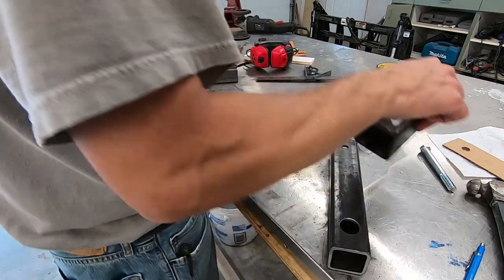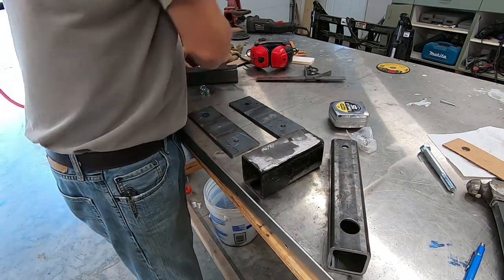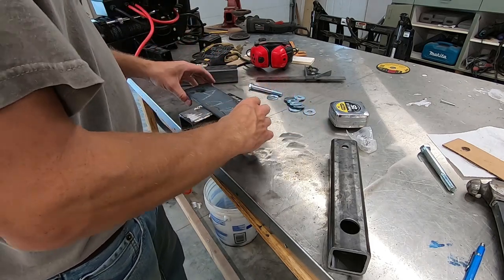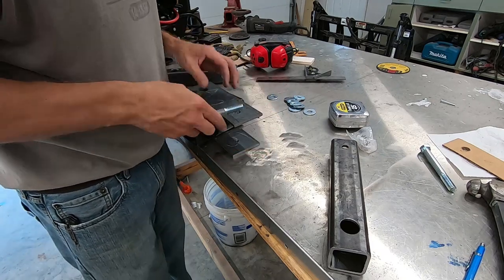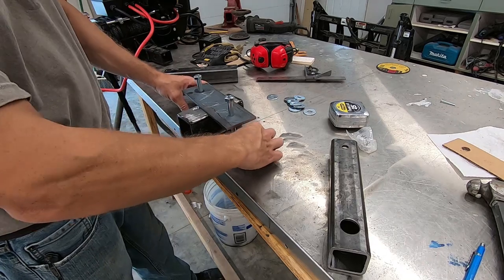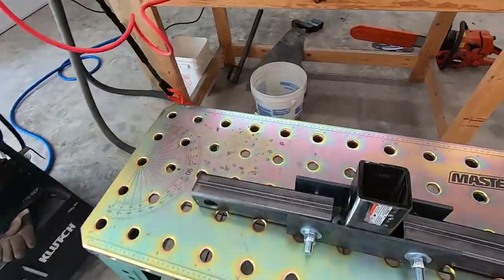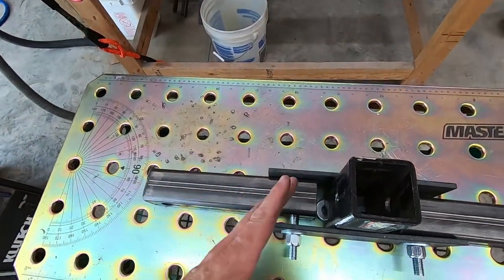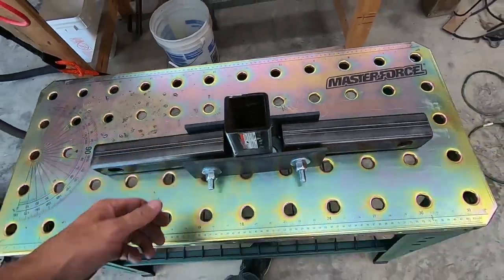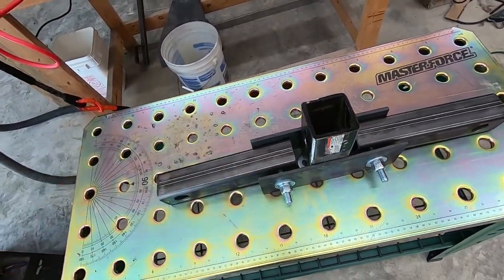I'm ready to get this receiver tube welded onto these plates. I've got some reference lines, but to keep everything as straight as possible I'm going to go ahead and bolt this thing together — that sandwiches it and creates a little vise for myself. I decided to assemble the whole thing so I could make sure I had everything nice and square, since I need to be able to get the bolts through these pieces of pipe once together. I've got everything measured and centered well, so I'm going to throw some tacks on there just to lock it into position, then take it back apart, get the wings out of the way, and burn everything in.